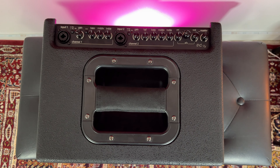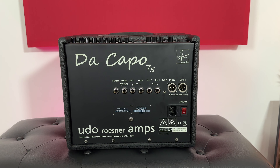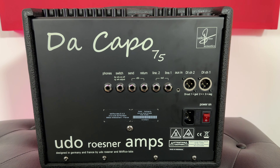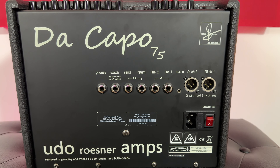The amplifier features two channels, so you can have two instruments going in, or perhaps a vocal microphone or something for talkback if you're doing a little gig in a cafe. It also has the capability to go through a big PA system, which lets you make the sound engineer's day by avoiding any microphones or DI boxes and just giving them a straight DI out from the back of the amplifier. In the studio, this is exactly what we're doing — going flat — and that's how we're achieving the sound today.